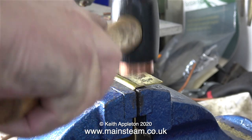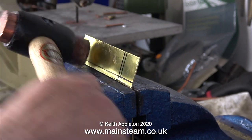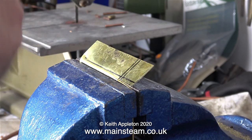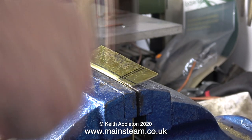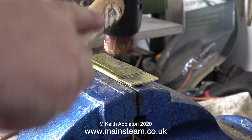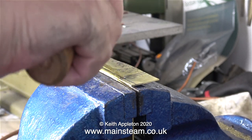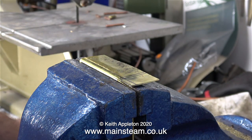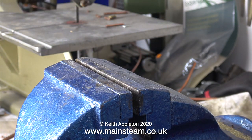You can clearly see the bend is much tighter now. That's one side done, so I've turned the part over in the vice and I'm now bending the other side. I forgot to mention I cut two slots in the brass — there's one at each side. The normal way to make a box or a shovel is to just cut two squares off the corners, but I want to save all the metal from a strength point of view.